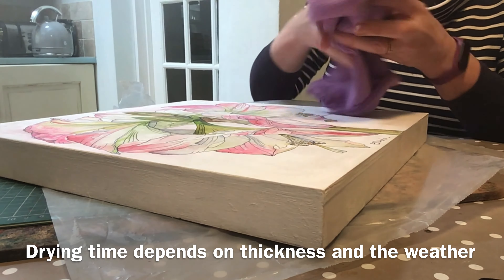Take a lint-free cloth and buff it. The other thing that some people use is like a coffee filter — that's really good for buffing the surface. But you've got to wait until it's dry, otherwise it will catch and you'll feel it dragging. When you buff it, there shouldn't be any drag on there. This is actually the second coating of wax that I've put on. I did the first coat that you saw, buffed that up, and then put a very thin second coat on.